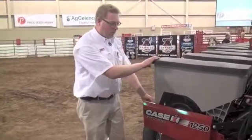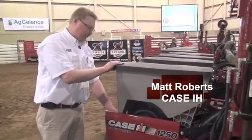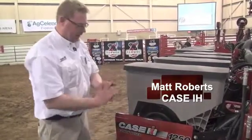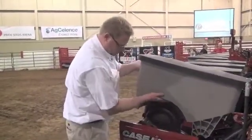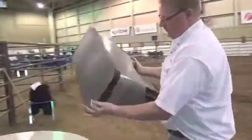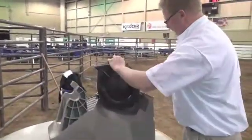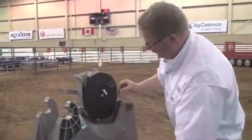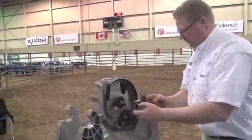When we've concluded our planting season and we're ready to put the planter away for storage, there are a few things we want to do to check it out and make sure everything is still in good shape. To take the row unit off, unclasp at the back, pull it up, pull off your airline, and your meter is free to come out. We tip it up on a table, undo our cover's three clasps, pull off the cover, pull off our seed disc, and then pull off our agitator.